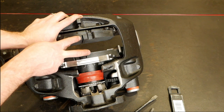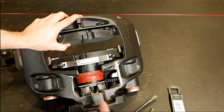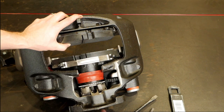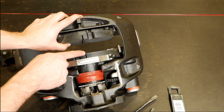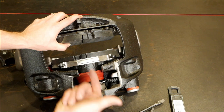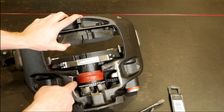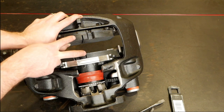How does the system know when it's at the correct clearance? The adjusting ring doesn't turn until the cam is at the very end of its travel. If the pads contact the rotor before the cam reaches end of travel, it won't turn the ring. It's only when wear increases the clearance — increasing stroke travel — that the adjusting ring turns at the end of that stroke. This is the auto-adjusting mechanism that maintains the correct running clearance between the pads and the rotor.